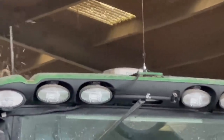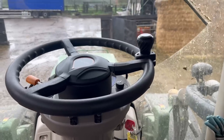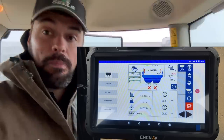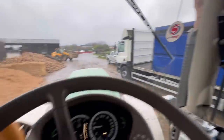He's got the sat-nav on there — that's what the white thing is. The auto-steer, CHC Nav. There's this thing in here, and this thing, so it does the auto-steering down the field. He's just sent me a photo of the ISO bus working on it, which I think is pretty cool. You could put it on an old tractor — make your old tractor auto-steer ready. ISO bus, and add a camera to it; it's got a reversing camera as well. You could just add all the technology in one shot into an old tractor.